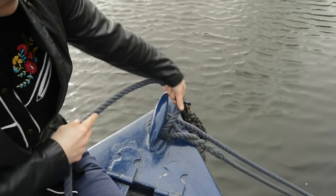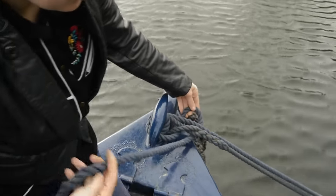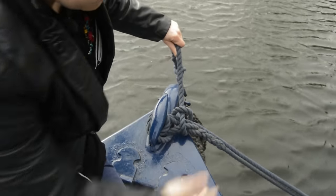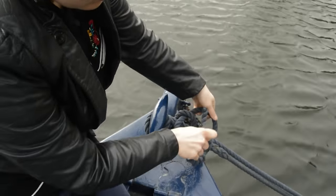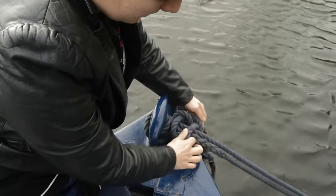Take the line and put it underneath where the rope joins the bollard, and make a letter D with both of those being completely underneath. Then take the end of the rope and put that over the top of the first line and through the hole that you've just created, and pull that nice and tight — that's your first half hitch. Take that line and pull it underneath again to form another loopy D shape, over the top and through the hole, and pull it nice and tight — and that is your second half hitch.